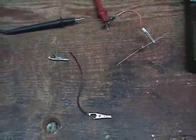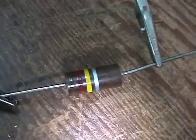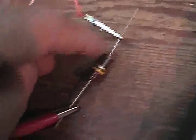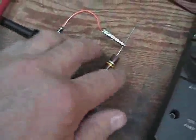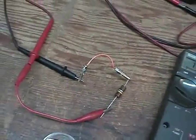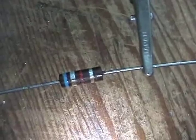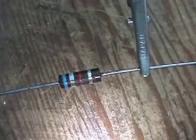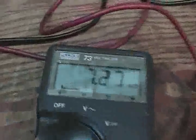Here I have to get another clip lead. Okay — 120,000 ohms, brown, red, and yellow. Now this one's reading a little high, and this is a brand new resistor. So you've got to be careful when you check your resistors. When you start using them, always check them first. Blue, gray, and red — there's the color bands on this one. 6,800 ohms is what's marked, and these are new. I'm reading high on this one too.